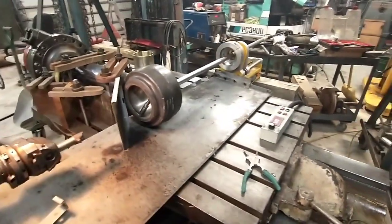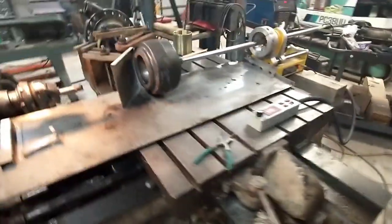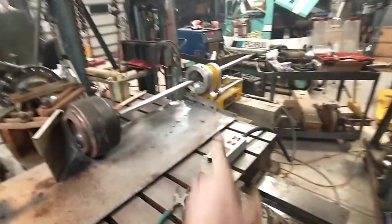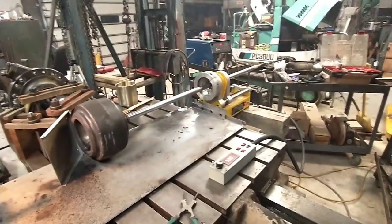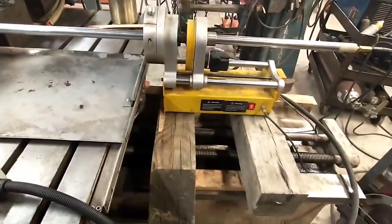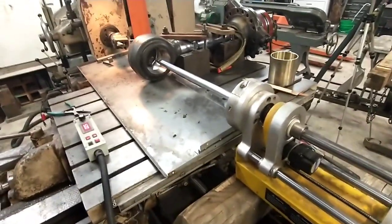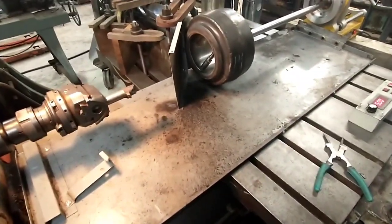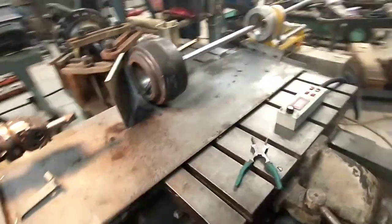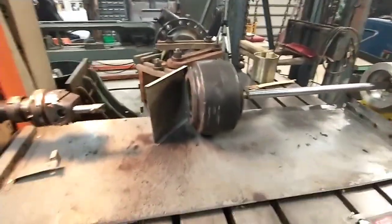I am set up and I've made a couple passes around in there. This is some serious rigging - normally this bore welder is designed to hang on the mounts for my line boring setups. You can see we've got some wood blocking and everything else, horsing around getting this thing on the correct centerline to weld out this bore. Got a hunk of sheet metal on the table to protect my mill's table from spatter. We're going to let her rip.